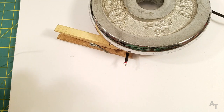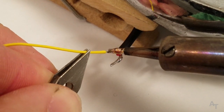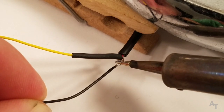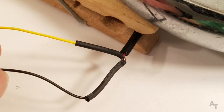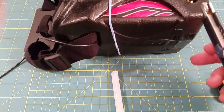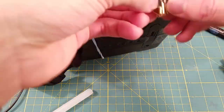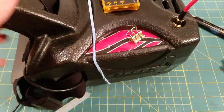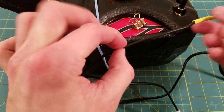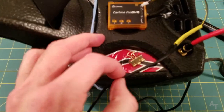Solder fumes — just kidding, don't breathe those solder fumes, always solder in a ventilated space. Now I'm going to solder the two positive signal cables together — get them up and bam, got a solder glob. Shrink the heat shrink right down, boom. Make a clean connection and keep things from shorting out — nobody wants that. That's basically it for our cable. I'm going to take this little paper clip and attach it right there to give us a place to clip this cable while it's plugged into our DVR, so if I accidentally pull on the cable it won't pull out of the DVR.